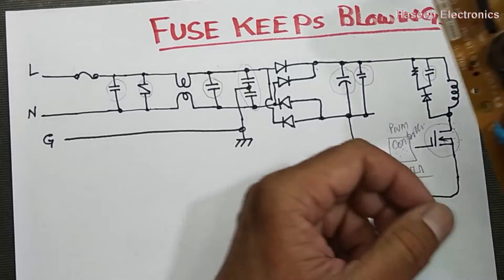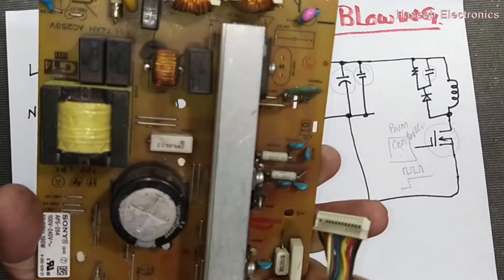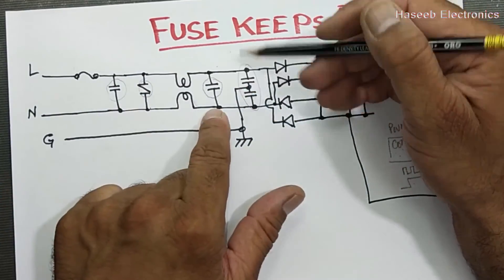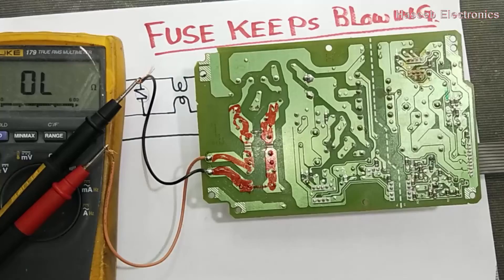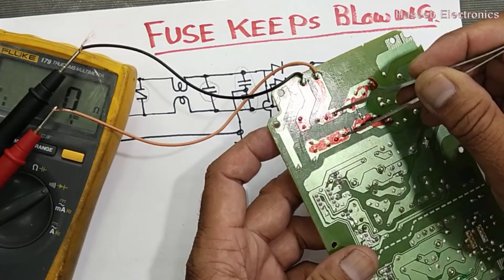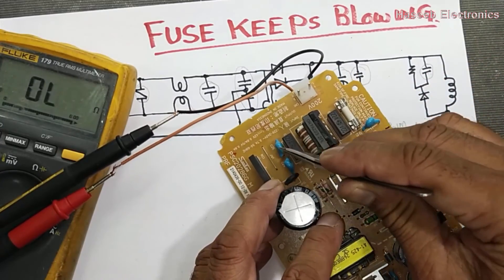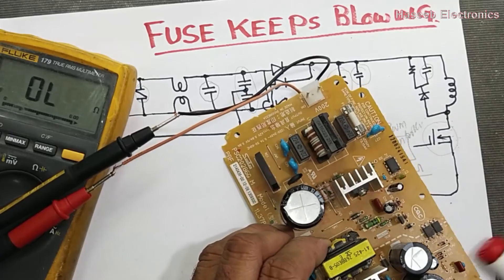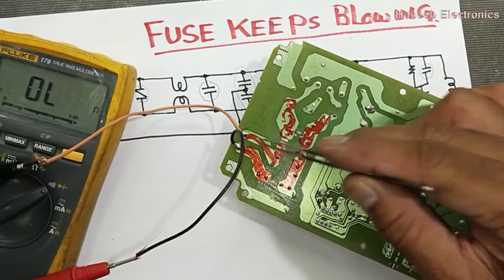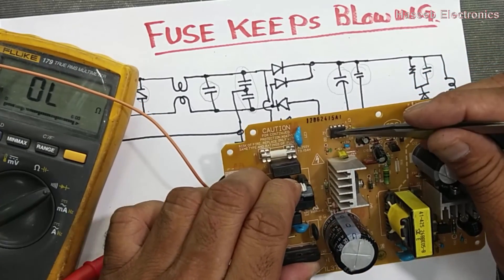Some circuits have a parallel ripple-removal capacitor — here we have just the main DC capacitor, but some designs have a parallel ceramic capacitor alongside it, and that can also be a cause for damaging the circuit. So all components in parallel across the two lines can be a reason to damage the fuse. In normal conditions the input resistance must be high. If the Class X capacitor, MOV, Class Y capacitors, bulk capacitor, MOSFET, or PWM controller is bad, any of them can cause the fuse to blow.